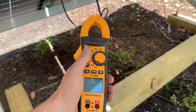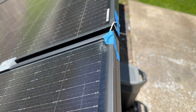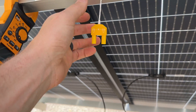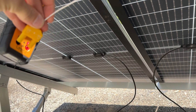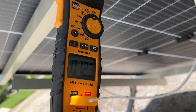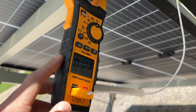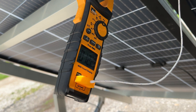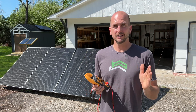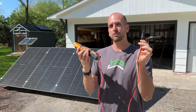We're seeing almost 10 amps running through there. There's also a thermocouple that comes in the kit — I place it right on the front of the solar panel and secure it with some painter's tape. Plugging in the thermocouple, making sure common and positive are correct, we see 123 degrees Fahrenheit for the actual panel temperature. That's well above standard test conditions, which is why the panel is derated slightly. This clamp meter is my go-to for solar measurements, residential electrical, and automotive use.